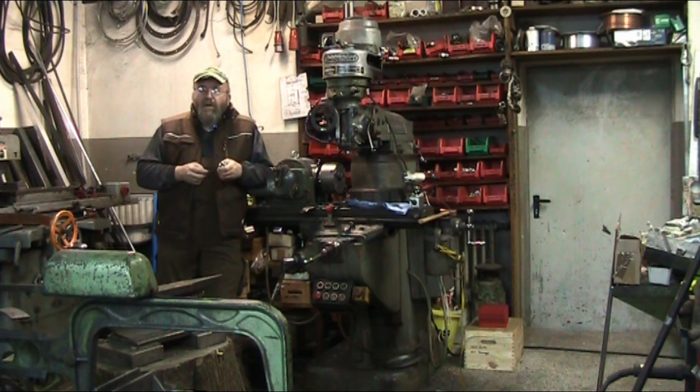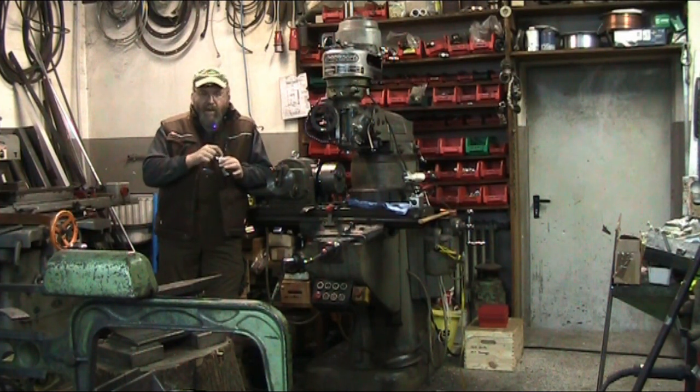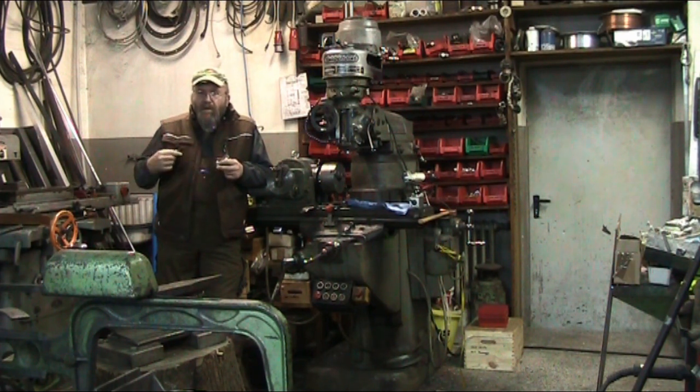And so the way you chuck up wood is you put it between centers essentially, with the center in the chuck or in the headstock doing the driving. So in order to do that, you've got four little knives, and for the tailstock you have to have this plate with a small ridge in it, because if you run the live center into the wood without it, you're going to end up splitting the wood.